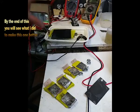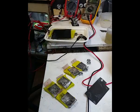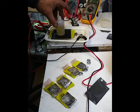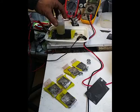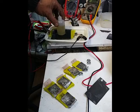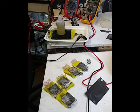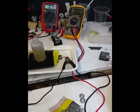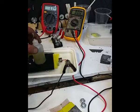And this is already working better than any one of those did, because what I've tried is obviously working. And again, you see that went up to 1.2 amps then. It's that flushing movement. I don't even know if you can see that. Actually, no, you can. Right, it's 660 milliamps there, look, 1.2 amps, 1.2 amps. Just that flushing movement.